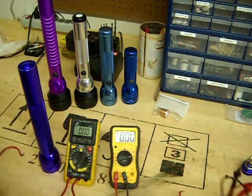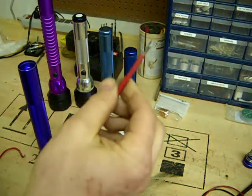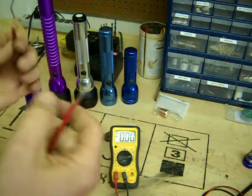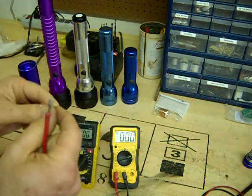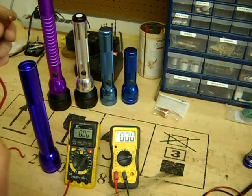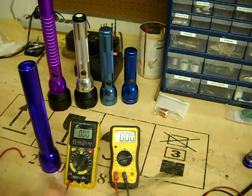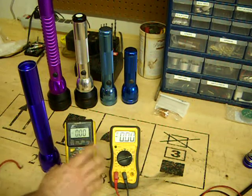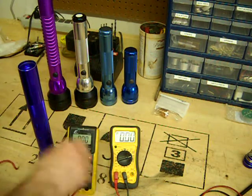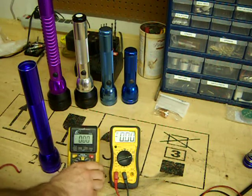These leads look thick but that's mostly insulation, plus there's resistance inside the meter. So what I tell people to do is I went and got some really thick wire — I don't even know what gauge this is, it just happened to fit real close in there — and I soldered the end to make a good solid contact. This is like something you'd find in your car, it's heavy, and plugging this in instead of these cheap factory leads makes a lot bigger contact area and these thick heavier wires eliminate the resistance. There will still be some internal resistance in the meter but it does make somewhat of a difference.